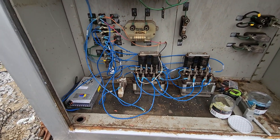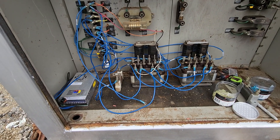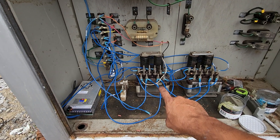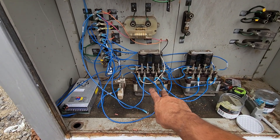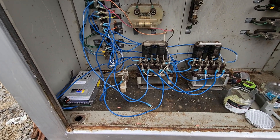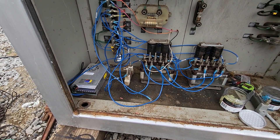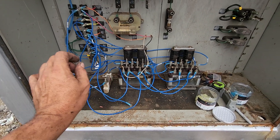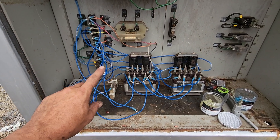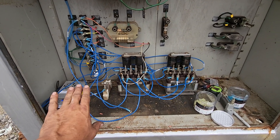How I basically did this was using these two DN-11 relays. When you hit the push button, it picks up one of the relays. And when it does, there's a hold-open circuit that runs from here over to a contact in the switch machine, then comes back. So when you push that button, it picks the relay up, and that contact stays energized until the switch machine gets all the way to the end of its travel, and then it drops out — which drops the relay and shuts the power off. And that does the same thing on the other side.